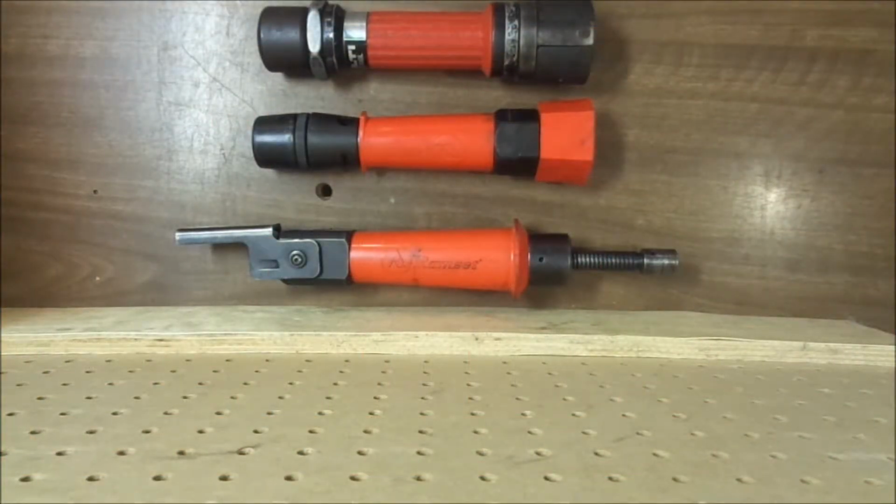All 3 of these tools operate pretty much the same way. You put a power source on top of the piston, strike the end of the tool with a hammer, that sets the fastener. And that works fine if you're shooting directly into concrete or steel. However, if you're trying to nail some wood to some base material, what usually happens is when you strike the tool with the hammer, the first hammer blow pushes the point of the fastener into the wood.